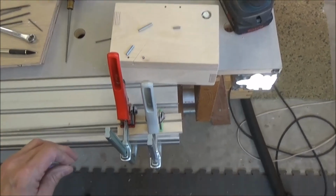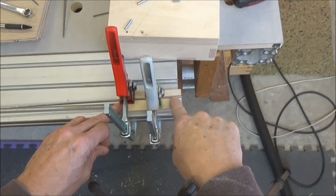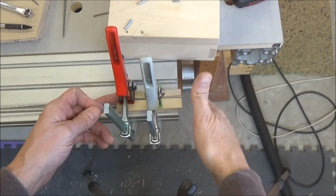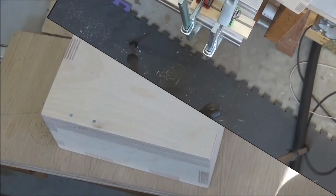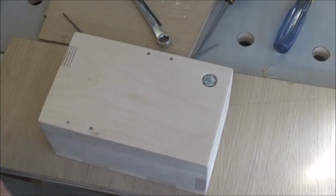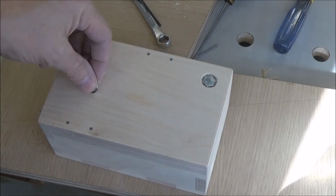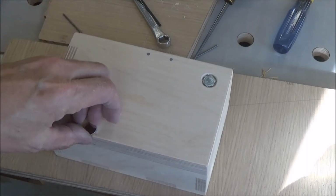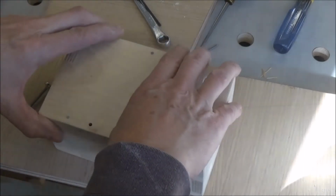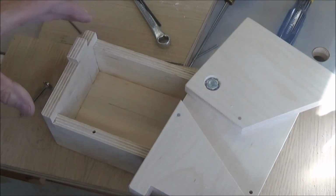And the way I cut those was with this little setup here. Just took a piece of scrap plywood, ran a shallow kerf in it, clamped my steel rod in there, and then just used my hacksaw and cut the lengths that I needed. I wish I could keep this look, but the sanded look, that line just about disappears. Let's see how well this works here. There you go.